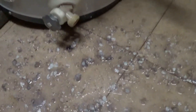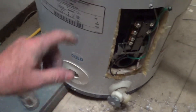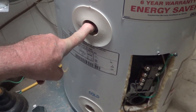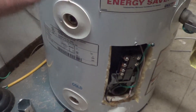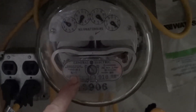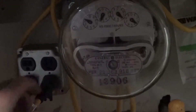What's interesting is that when this unit was off, we had a rotten egg smell. We turned it off to save energy for a while, then turned it back on and got the dreaded rotten egg smell. It might be that the anode was never very good in this unit. We had this thing hooked up to a watt-hour meter — an I30S — to keep track of long-term power usage. Here's the AC power supply line out of the wall; we had a dedicated circuit on this with a power meter hooked up.